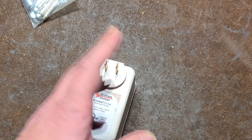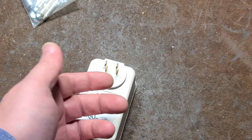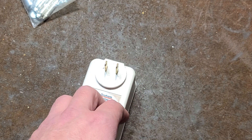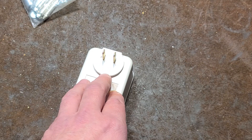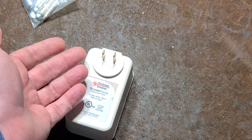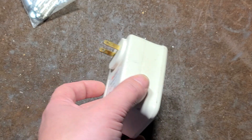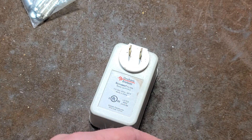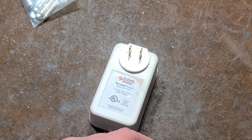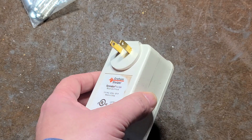Cell phone chargers, TVs — all these things have what's known as switching power supplies, which turn on and off at a rapid rate and introduce a bunch of noise. Even power lines pick up radio noise because they're big pieces of wire. That can somewhat reduce electronic reliability, but it actually tends to be heavy-duty noise like in industrial environments where big motors are turning on and off, or things plugged into the same circuits as welding machines.